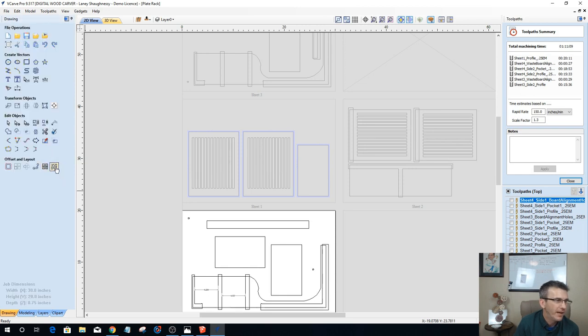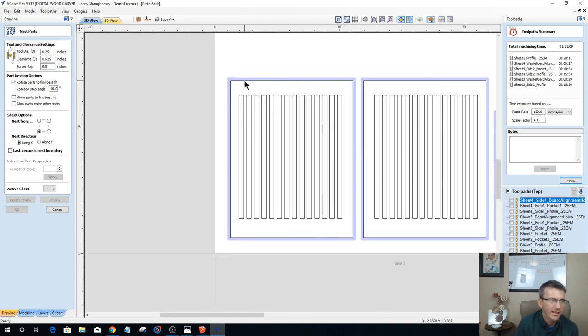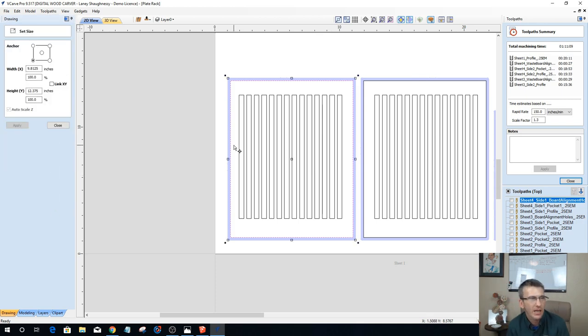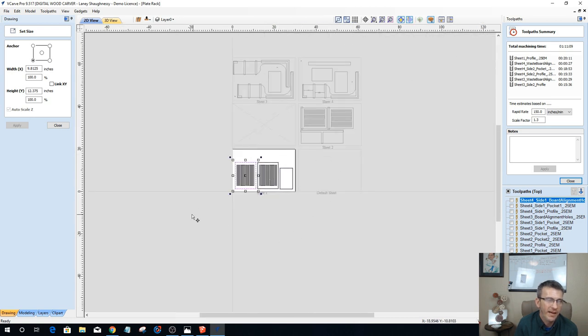If I look at sheet number one, my panels are all four the same size. The size of that is roughly 9.8 inches, 0.8125, 9 13/16 basically, by 12 3/8. So I could get them out of a 1x10 board. Nope, 1x12. Instead of four sheets 20 inches, I could do 1x12s, and I could get all of my slats and my shelf boards out of 1x12s.